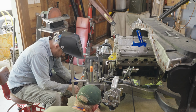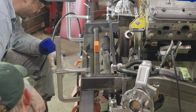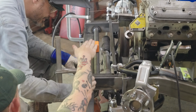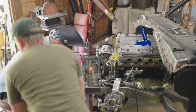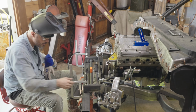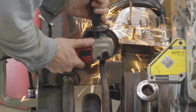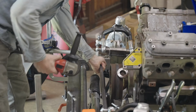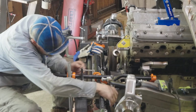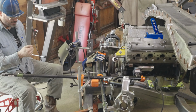This is the part of the assembly that really had me freaked out from the start. See, tacking all this stuff loose in the air leaves a bunch of opportunity to screw things up. And without being on a fixture table or some sort of jig, all I can do is obsessively measure for level and square at each step of the assembly. So that's exactly what I do. It's slow and steady all the way. We have room to settle down, so I can tack the top and then pull it down.